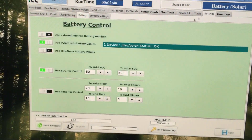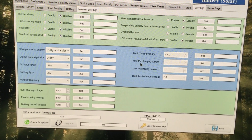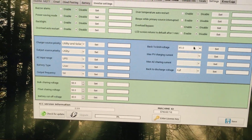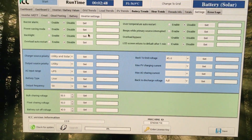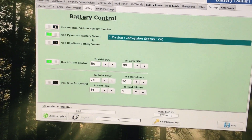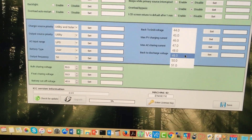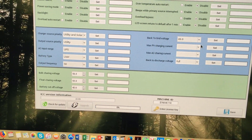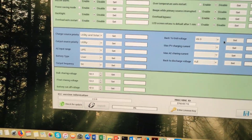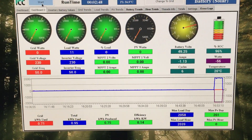The only remaining step is to adjust your inverter settings. For a single system set it in the inverter settings; for parallel use WatchPower. Change your back-to-grid voltage so the hardware doesn't switch to grid before the state of charge threshold you've set. Start at a high voltage like 49 volts, check what the state of charge is when it falls over to Eskom, then drop it one volt at a time until you find the sweet spot. Set that as your back-to-grid voltage and you're done. Any questions, please shout - thank you, ciao.